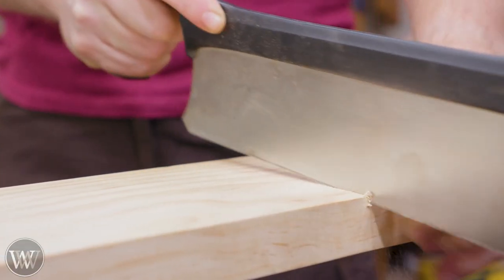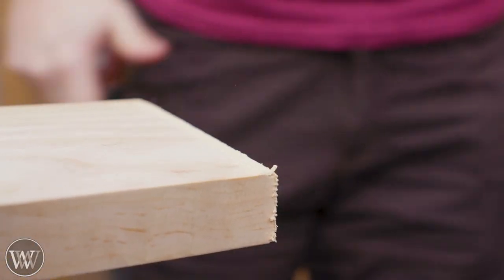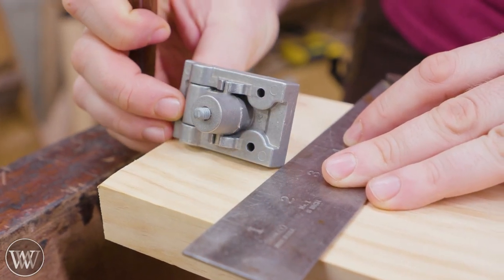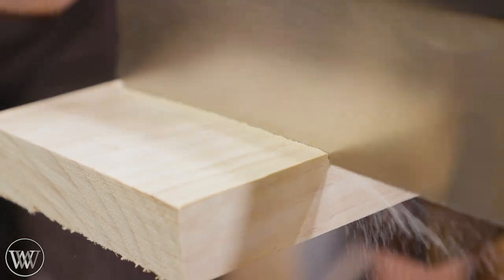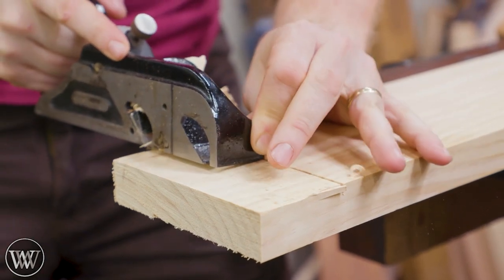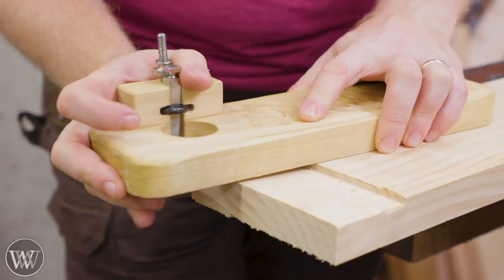There's going to be a sub base piece, which I'm using this chunk of pine — it's actually a really nice piece of clear pine, one inch by six inches solid that I milled up for a project years ago. This will hold the depth stops, and I'll have a link to those in the description. They're relatively simple, and for something like this where they're open and you can just blow them out afterwards, they work pretty well. Rather than recessing them into two separate pockets, I'm going to make a large rabbet on the end and carve out grooves for their rounded surfaces. I'll start with a saw to cut down to the correct depth to create my depth stop.